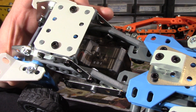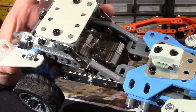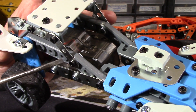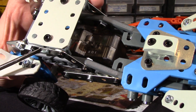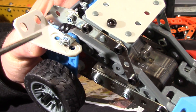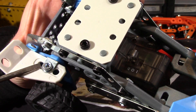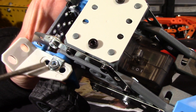There are a couple of places where you get a slight bending or deformation of a part — very slightly — where you layer parts, which is normal. But I'll just point them out. Here for example, you've got a narrow strip underneath and a narrow strip on top, but nothing at this end, so there's a slight pull in there. Another one is here with these angle brackets crossing this new recess — there's a little bit of a gap while it crosses that recess, so it pulls it down a bit, and you might find it a little bit dished when you take that apart.